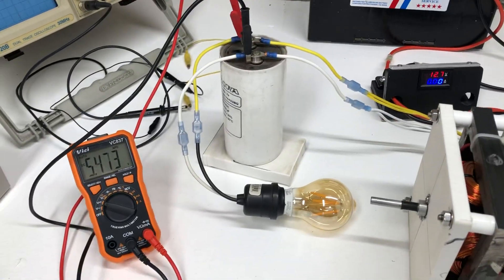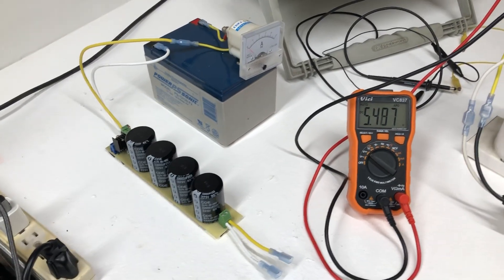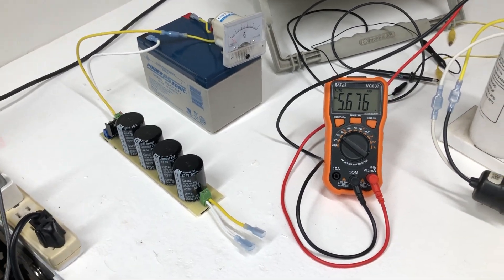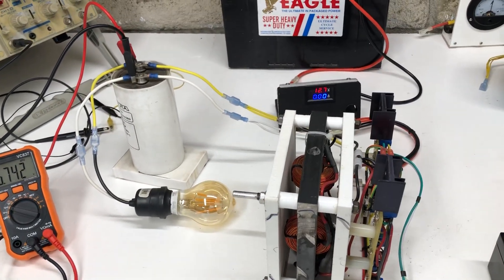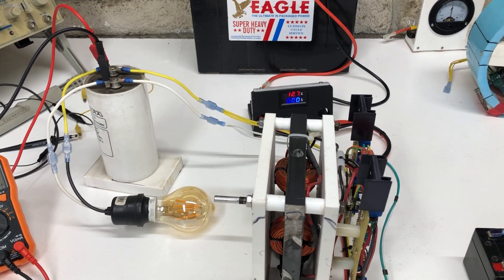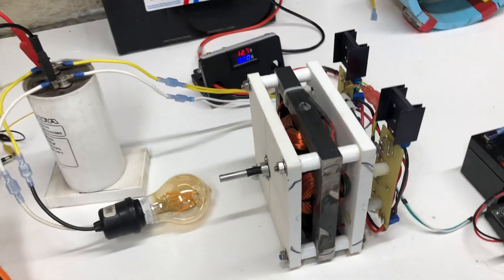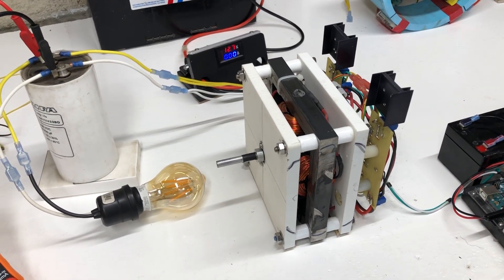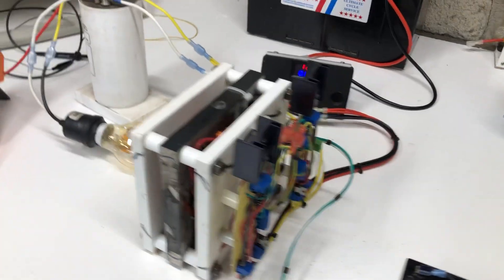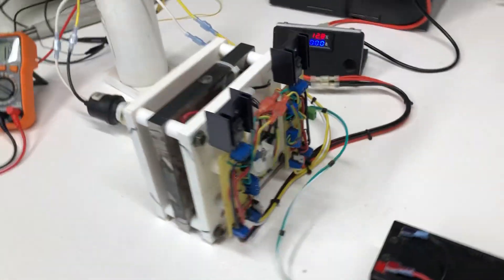The output could be put into this capacitor to run light bulbs or whatever, or you could put it into this pulse capacitor discharge system that I made — at 16 volts it discharges into a second battery. One of these motors I had running as a fan motor that actually ran Christmas lights around my house while also running a fan, which was pretty neat. This motor was designed specifically for high torque — RPM is about 2,000 at full speed, and full load is about 1,500. I thought I'd share it with everybody. Thank you for watching.